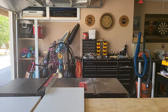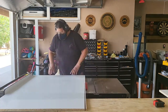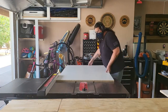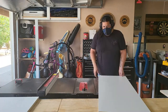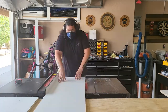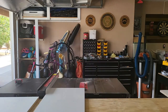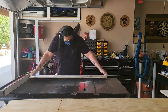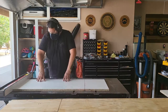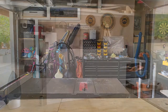If you're paying close attention though, you'll probably notice that I do get out of sync and make a few cuts in a single pass, but they all came out fine as well. I suspect that's due to the brand new 80 tooth blade I was using, but to stay on the safe side, I'd still recommend using the multiple pass technique if you really want to be sure that you get as little tear out as possible. Who knows if an older or fewer toothed blade will perform as well. Better safe than sorry if clean cuts are critical to your project.